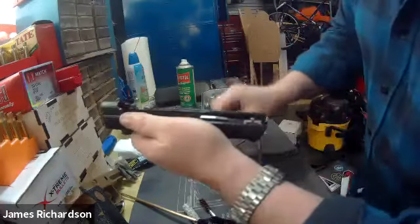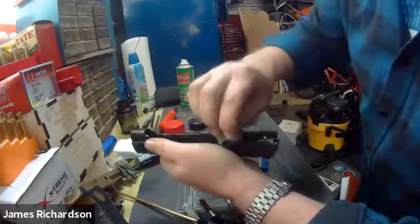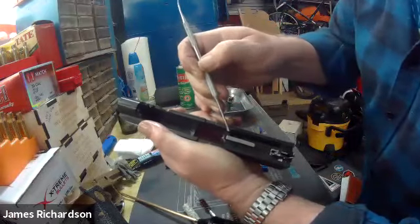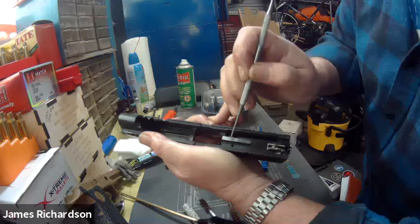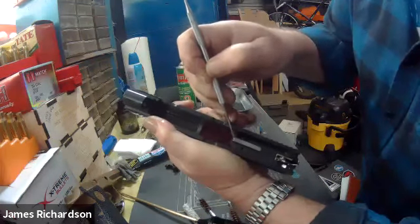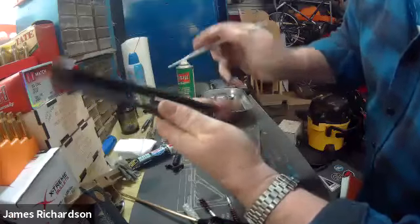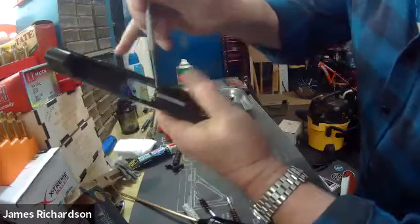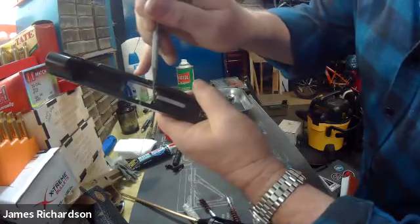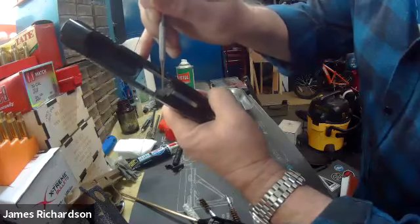While you're doing this, you're also inspecting the firearm for any kind of a crack or anything that strikes you as unusual. You'll look for a little burr right here. You see that little dent — that doesn't worry me. But if I saw a little burr on one of these surfaces, I'd be concerned. Your ejectors and extractors — you want to look at these and make sure they're not cracked. These can crack. So you want to make sure there's no chips or cracks in this.